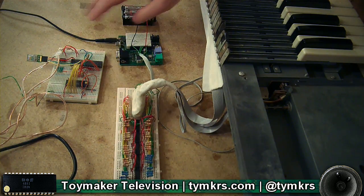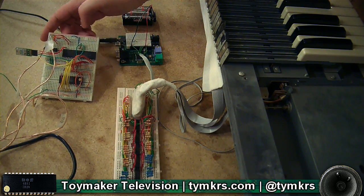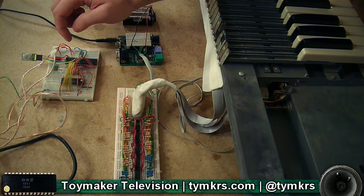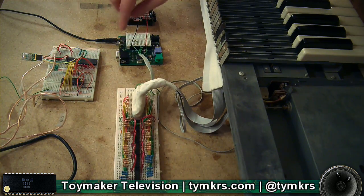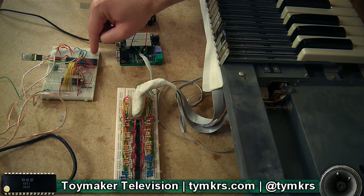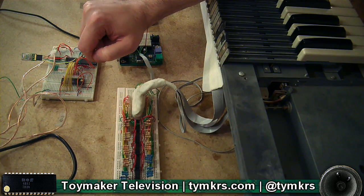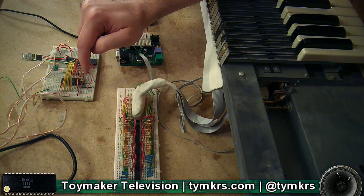Now this has audio out, video out, keyboard and mouse input — but you don't have any of that here, just doing it straight up. This is connected to the SID chip here. So instead of controlling just a headphones out, eventually this serial cable is going to run to this board and this propeller is going to scan the keys, figure out which ones are pressed, and use that information to control the SID chip. And once I get that going — more than one SID chip. We have four, all from different locations. But I don't know how to design the power supply for the 12-volt side on these SID chips, so I'm going to need help with that.